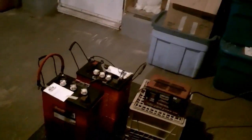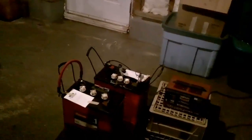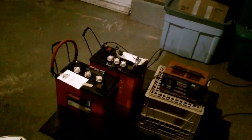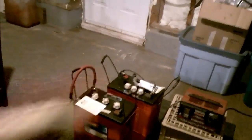I had these batteries along with four others on the system and it was showing fully charged but wasn't actually charging them — they were showing full voltage, so it was tricking the charger. What I had to do is use this old charger here. It has no regulator, so it won't stop when the battery gets full charge — it just keeps dumping power, which is exactly what I need.